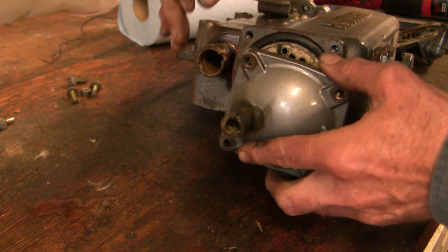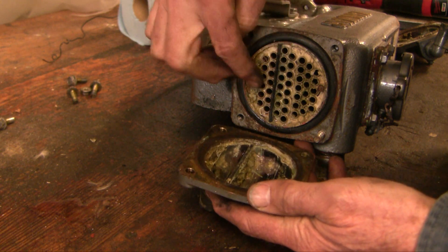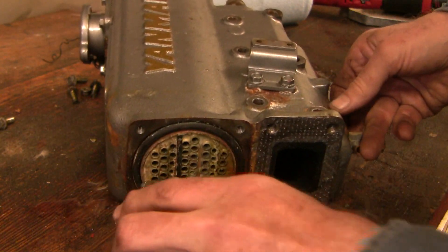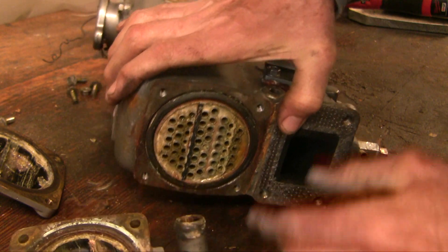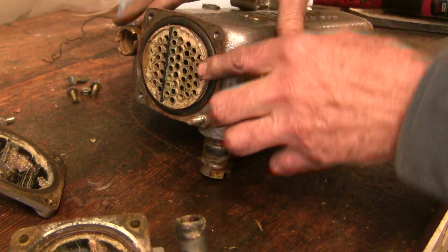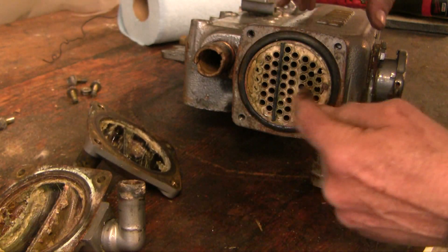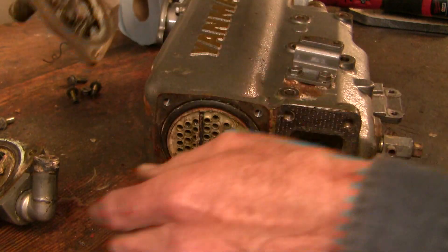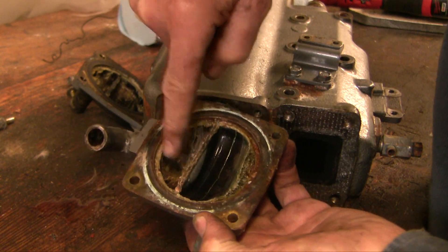This is really interesting. The salt water comes in here — the cold salt water comes in and gets to these three rows. You've got this horizontal line so the salt water can't go into this side initially, and it goes along those three lines. On this side you've got the same kind of thing — a horizontal line that prevents the salt water from commingling. So the three bottom ones come out and go back in through those two. It comes back to the front out of those two, and now it's in the top part. It goes a zig-zagging course back and forth until it gets to the end plate, and it finally comes out here and out the exhaust.